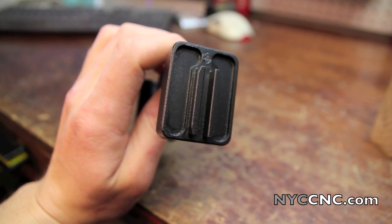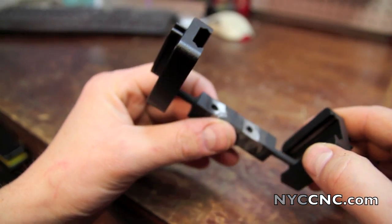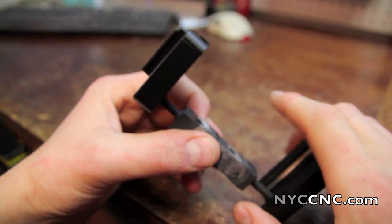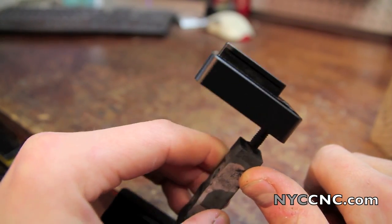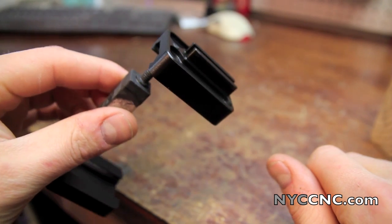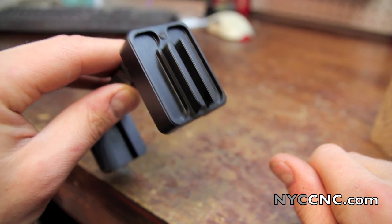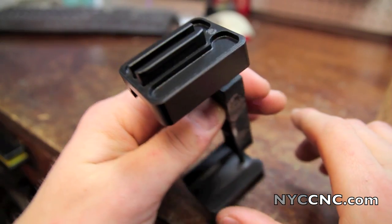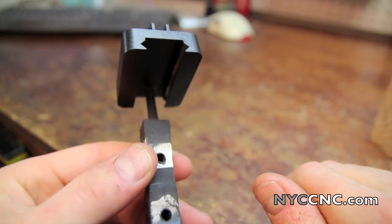It's been about 10 minutes — these have cooled, they're not dead cold but they're plenty cold to touch. And here they are. These are plenty good for my purposes today, but I will tell you this is actually not the best powder coating job I can do. You can see in the corner there's a tiny amount of pitting. If you're having troubles, make sure your air quality is good, your air is dry, and parts are clean. My biggest criticism was that the paint adhered to the part very, very quickly and I was probably blowing a little bit too much paint, which usually means you've got too much air pressure. It can also change based on how full your powder hopper is. If I had painted these more slowly, less paint would have gone on and it would have been an even finer job. But this is great — it's a really high quality finish that looks very professional and no one would know you're doing these out of your garage.